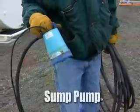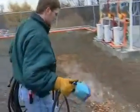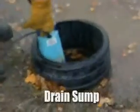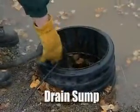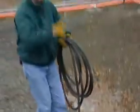This is our typical sump pump. This is what we're going to use to extract the water out of the dyking area. As you can see, it's got a perforated screen right here. We want to go ahead and place this right here to the storm water drain. Periodically, we want to check this and make sure that the screen is not plugged up. We'll drop that straight down into it, and we'll take the hose and go ahead and uncoil it and run it over the earth berm dyking over here.